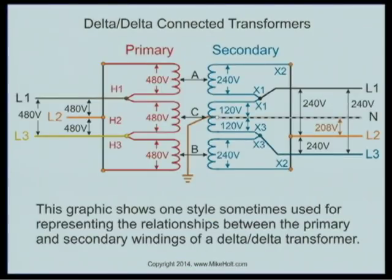Here is another way to look at what we just discussed — you'll sometimes see this marked on the equipment itself. Here is phase A at 480 volts, phase B, and phase C on the primary, and the secondary is 240. Steve confirmed the turns ratio is 2-to-1. These windings are all connected in series — that's a delta configuration. Where they join together is where two transformer windings meet: line one, line two, and line three. That's delta.